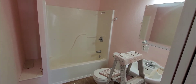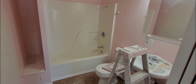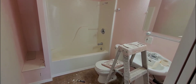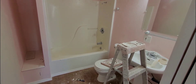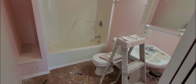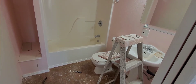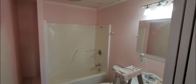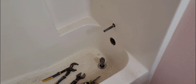Pull off a couple screws and that takes off the escutcheon. Then below that, your bathtub filler spout is usually just unscrewed — righty tighty, lefty loosey. Right below that, your waste and overflow: undo that screw and then the two more screws that hold it in tight and you'll be ready to go. Once we get that off we'll start cutting her out.